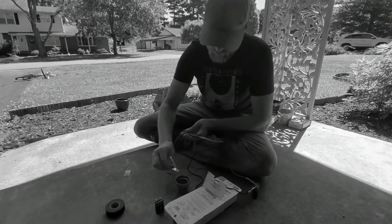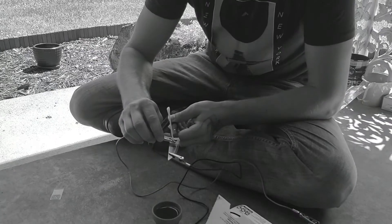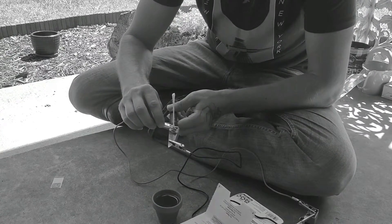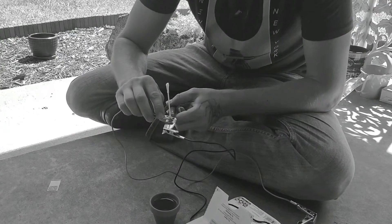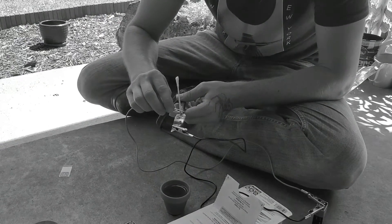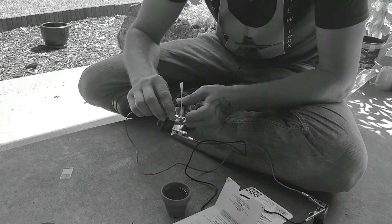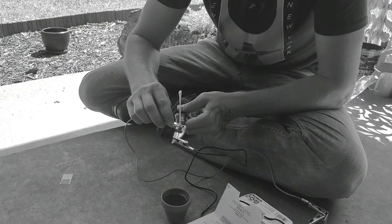Make sure it's nice and wet. You basically just hold it over the area where the sticker is cut out. If you hold it long enough, you can hear it sizzling very faintly — it's kind of hard to hear. Not a whole lot of power; it's just a 9-volt battery, but it's enough. It burns into the steel and leaves the design etched into it.